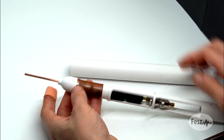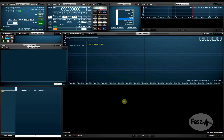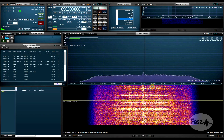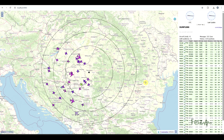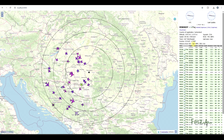Compared to the simulation, the added plastic has a non-negligible impact. To finish testing, I connected this to an SDR Play device, put it up somewhere on the side of a building, activated the built-in ADS-B plugin, and started listening. While it should be no surprise that it does receive ADS-B signals, it still seems to be working quite well — the furthest aircraft I can pick up is around 200 nautical miles or 370 kilometers away, which is pretty decent. And it's worth mentioning that I did not use any sort of filters or amplifiers — it's just the antenna directly connected to the device.